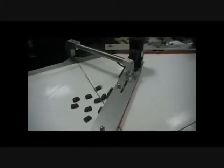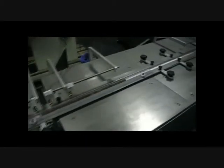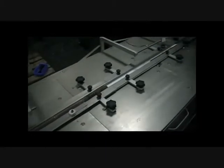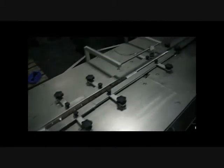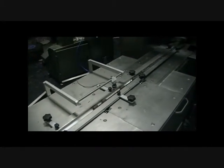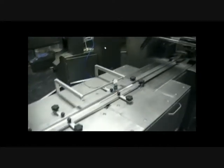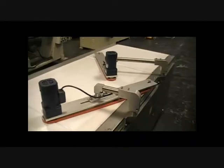So we go to the top end of the machine and give the machine some product by turning that. So that conveyor belt now going, and the sweets or candies will go down the track and be fed into the machine. The sensors take over. If there was constant product, the machine would go faster, but there is no constant product because we're just doing a little test. But away the sweets go, and basically that is how you start the machine.